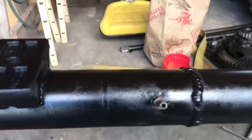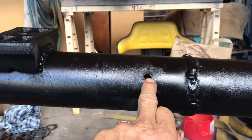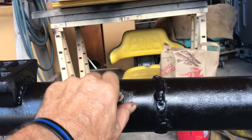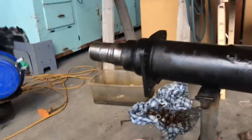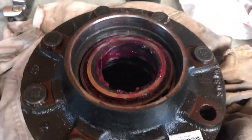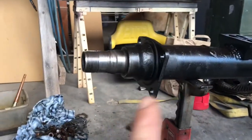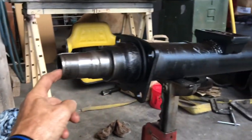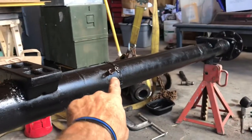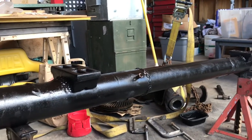This tube is completely sealed, so I'm also going to have an oil bath system in this. This is going to end up being my filler because as it sits it'll fill this half full of oil. This will get a vent on here, but it'll have oil plus it'll have grease. I'm waiting for a seal to come in — once I grab that, throw the seal in, and slap it together. But before I put it together, I'm going to fill this tube half full of gear oil. I'll stick it in through the end here — that's just for topping it off if I need to. Probably won't ever have to, but if I need to check it I can.